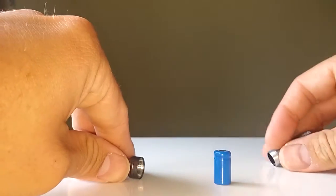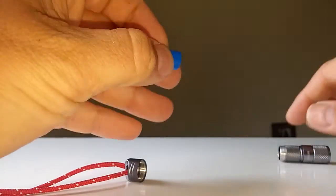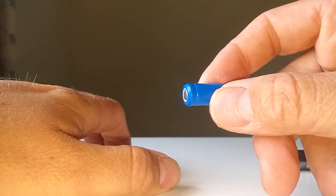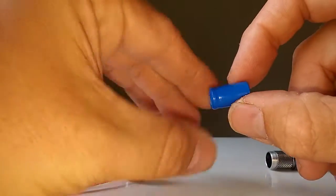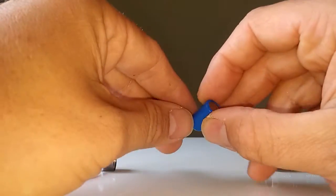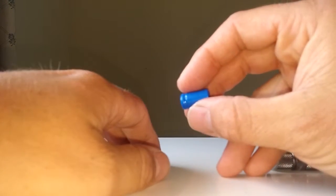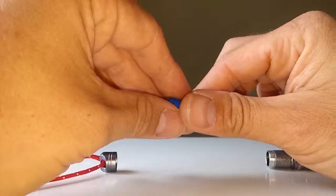So a little TM180 battery — it's a tiny little wee thing. The problem with this is that it's only 90 milliamp hours and it's a 3.7 volt lithium-ion battery. The problem with that is there's basically no chargers around that you can commercially buy that will work, because the charge rate is too high and it's so tiny it won't fit into any new chargers.